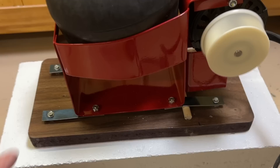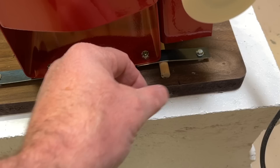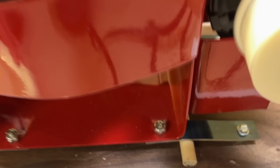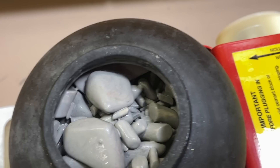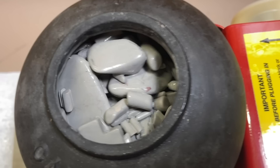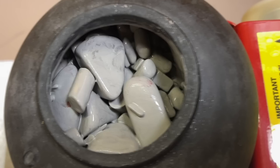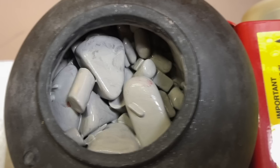So I've got this all put back together. I took out the four screws, pulled the dowel off with vice grips — it crushed the end so I replaced it with a new dowel. The measurement from here to here is 2 centimeters, the same as my other one. And look at the difference in the action now — that's what it should look like. So if you buy one of these, if you've got all the water poured out and just wet rocks with your grit in, it should be moving about like that.